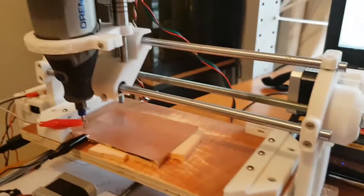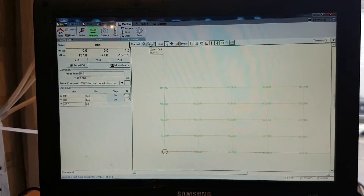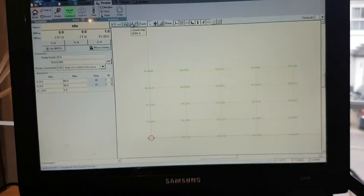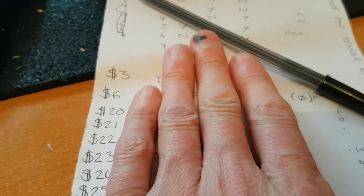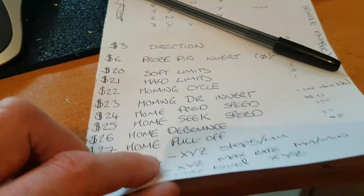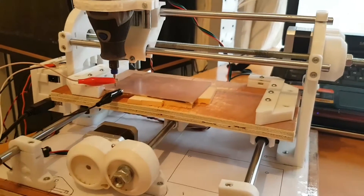Issues I have with it so far: just getting to learn CNC and GRBL. I am using GRBL 1.1 which has a whole series of codes instead of descriptions. It uses things like - it doesn't show you what the variable is, it just gives you a list of codes and you have to know what they are and set them according to the list. It is all on their wiki. So just getting the direction right and the homing right, and testing out the switch.